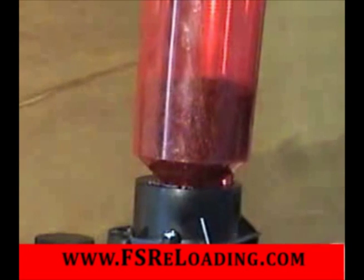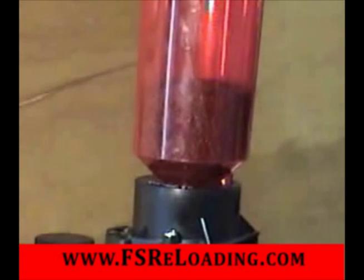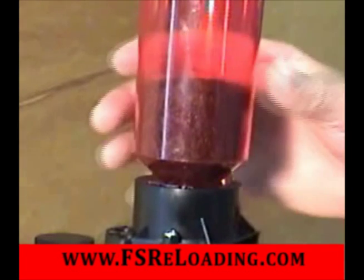Remove the 2 brass hopper nuts and lift off the hopper and return it to the powder container. Take this opportunity to clear any loose powder debris from the body of the auto disc. Orient the disc so that the proper cavity is next to the drop tube hole.